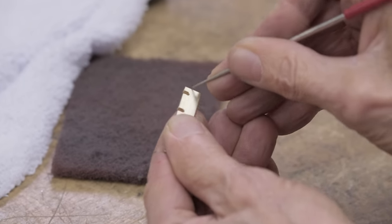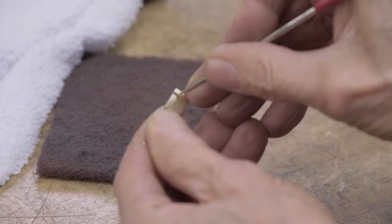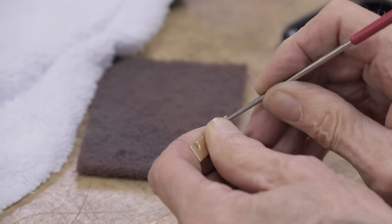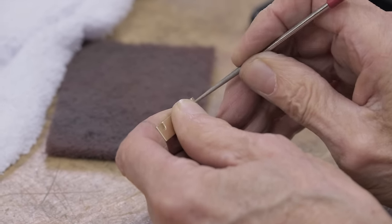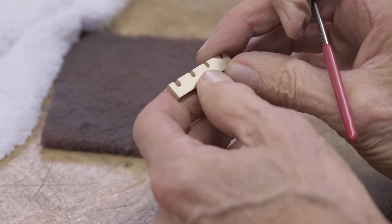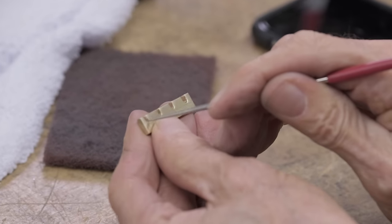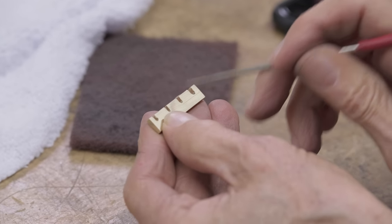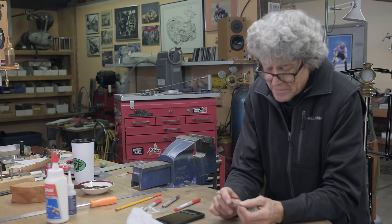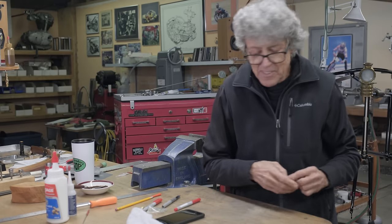You can see how the hole is there and that it comes up. It's like a little hockey stick down there. And the other thing I did wrong is I couldn't find the drill. I needed a 45 thou drill and I only had a 60 thou drill, 16th of an inch. So those are three things that went wrong. If you look at the back, well, no, that doesn't look good there, but these holes look good. These slots look good here. I am learning how to make a brass nut, and my first attempt, not easy, but that's okay,